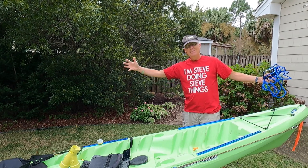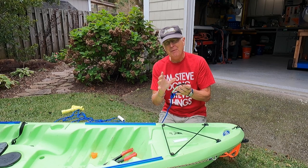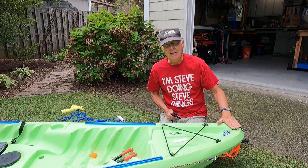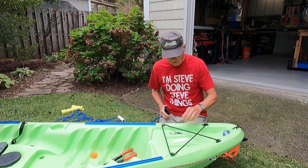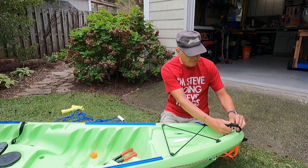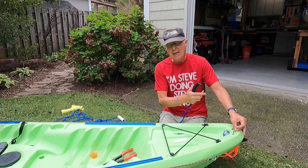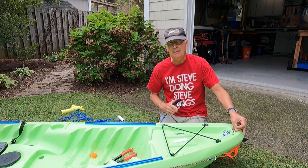On my new tandem kayak, the first thing you need is a big carabiner — don't get the small one, and I'll explain why later. The challenge is attaching it someplace to the front of your kayak. This kayak came with a pad eye attached, but it's not big enough for me to get this through. So what I'm going to do is rivet on a stainless steel pad eye up front that will allow me to quickly insert and remove this. Whatever you attach to has to be big enough to allow for rapid insertion and extraction, because this is all about safety.